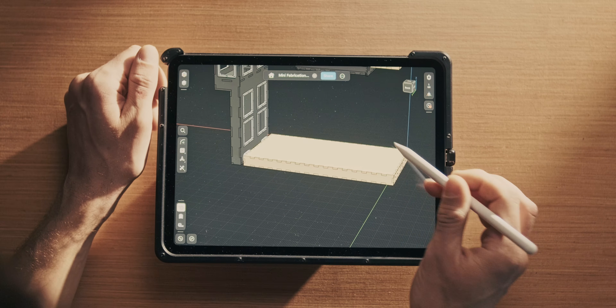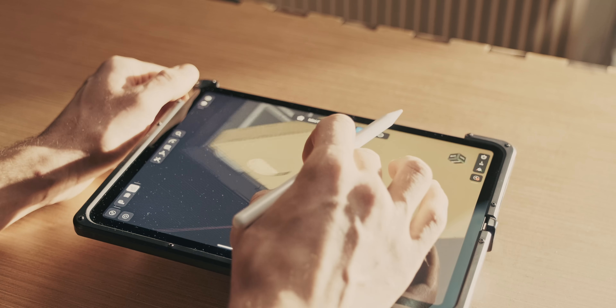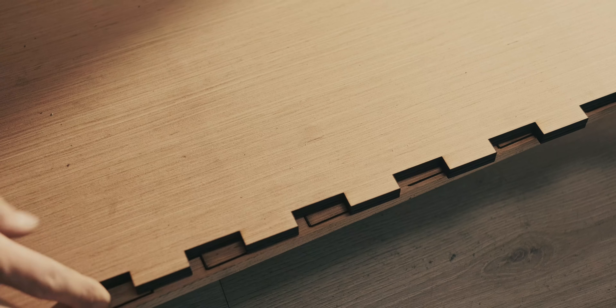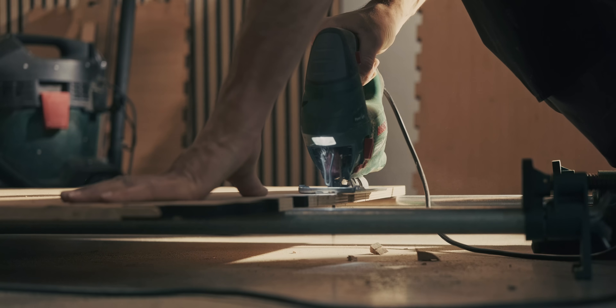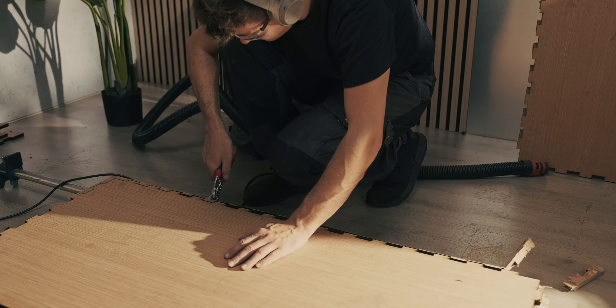Next is the bottom plate — super simple, it holds the 3D printer and the laser cutter, and has some gaps at the bottom to access the bolts, which are also exactly the right size to put some spotlights in. The bottom plate cut went really quite well in a single pass, but the top plate didn't — it wasn't able to cut through at certain points due to another overheating issue. I grabbed one of the other cuts, put it on top, and marked out where I needed to sort another piece, which worked out fine. I needed to use a Knipex wrench to break off excess pieces, and I think I may have moved the laser head upward slightly so it wasn't in focus properly.